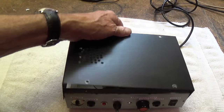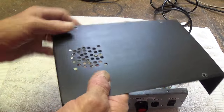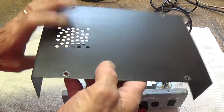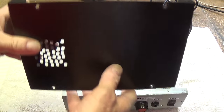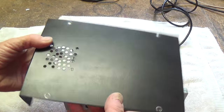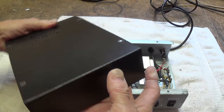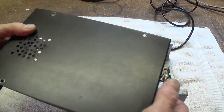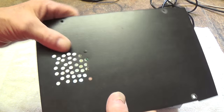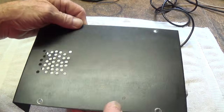The screws are removed and the cover slips off. You're going to laugh when I tell you where this came from—it's an old piece of galvanized sheet metal I had left over from making irrigation canal shutoffs. I just bent it in the vise using 2x4s to secure the edges and fold it over, like I did in my Supro video, and then drilled some holes in the top for a heat vent and four screw holes so I could secure it to the chassis.